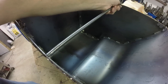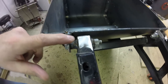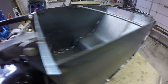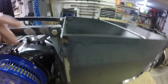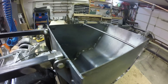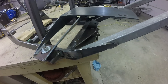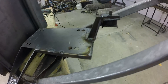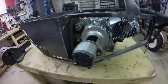You can see these rods I used to maintain distance — they can be pulled right out. Then I welded some bungs into the frame where I'd cut it, and I've secured the tank to the frame with these brackets on the back and the front. Those will be strengthened right across eventually once I finish welding the rest of the fittings into the tank. So the top of the tank actually becomes part of the frame. I was also able to get the engine remounted in the forward position — I made a new mount out of the same plate I made the tank out of, and it's sitting pretty nice, nice and tight in the front. I think I'll have ample room to hook up the hoses and everything else I need to do.